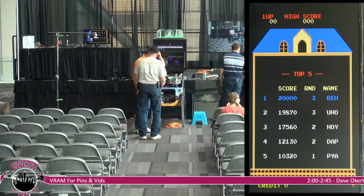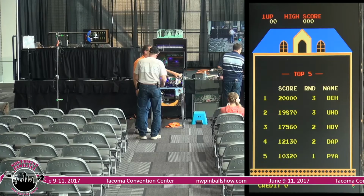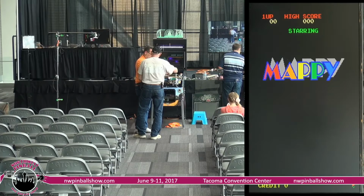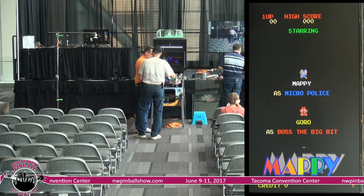Are you talking about CPS2? One ground, one positive? Yes, the problem with those is usually, big box like this, it's tight. Blue on top, black on the bottom. If the batteries have ever gone bad, these things are starting to corrode. These will start to corrode, and you'll get a patina of oxidation, and it won't solder.